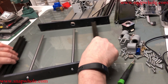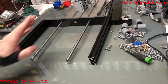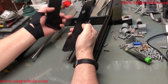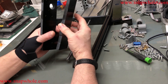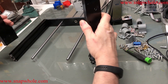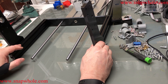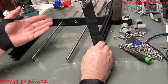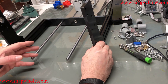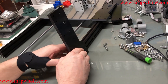I've got one end on — the front. I chose to do the front first because it's easier to get the sides on from the back. This bearing is the same as this bearing; it lets the screw rotate on one side. The stepper motor mount goes on this side. From the back it's on the left, which means from the front it's on the right. If you put these on the wrong sides, your print will come out mirrored or not at all.